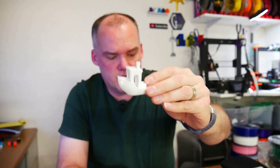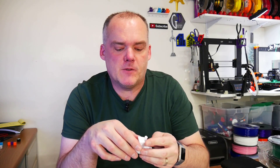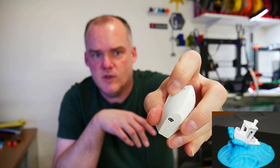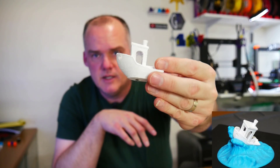With the layer shift solved, I took extrusion up to 90%. Here's Benchy number seven — pretty nice, though without really good surface quality. Then, last in my Benchy series, I took it all the way back to 100% flow and also turned down the travel speed because it was traveling too fast and shaking my whole table. Here is Benchy number eight at 100% extrusion. I still have some pretty rough edges to work out — not sure if that's the printer or the filament. Not a bad Benchy, not a fantastic Benchy, and I haven't cleaned it up at all off the bed.